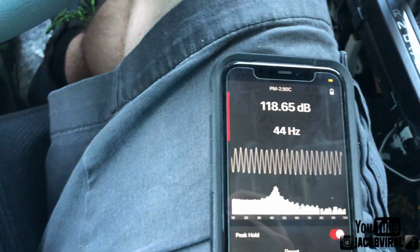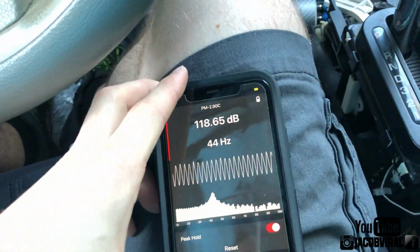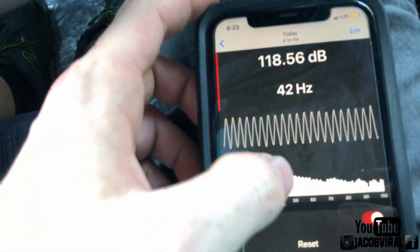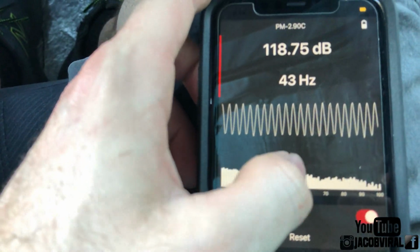All right, so my peak didn't change, and I took that piece of wood out, and you see how I went down maybe about 0.1, maybe 0.2. That shows that my port area is about where it's happy. So I went from 0.56 to 0.75 to 0.65. So right around the ballpark of where my port area needs to be.